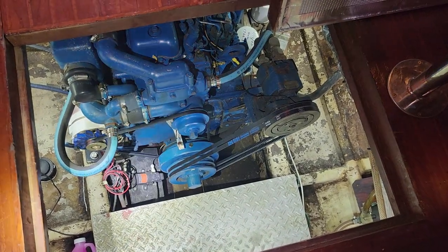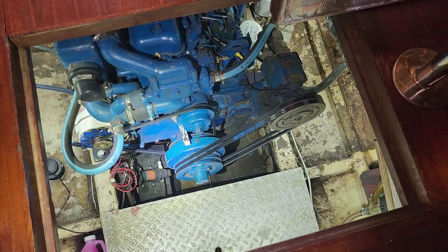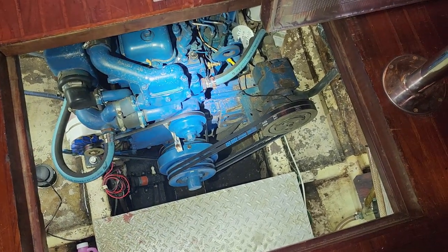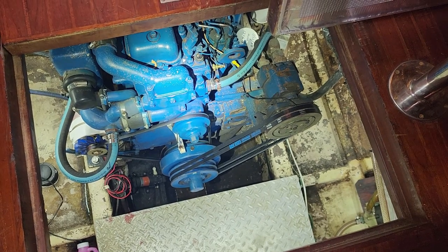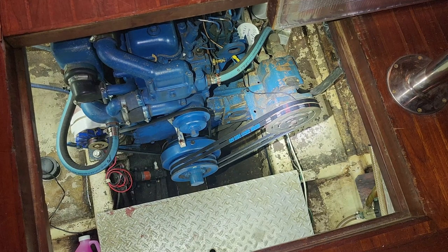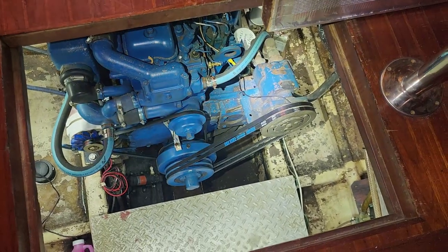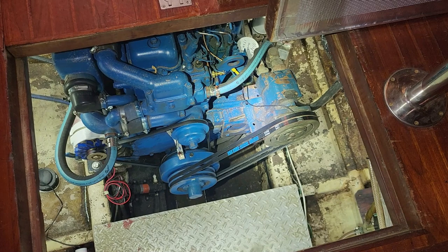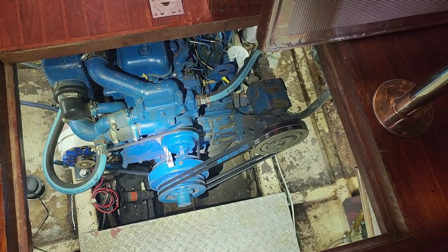The authority or horsepower of the thruster motor is variable depending on your RPM. A lot of times backing into a slip on a nice day, 700–800 RPM is enough to bump the thruster gently. On a sporty day, I'll operate it up to about 1,000 RPM — they recommend no more than that. One reason they don't want high RPM is because the clutch engages with a hard thunk, so high RPM is tougher on the clutch and components. A good strategy: engage at 800 RPM then throttle up to 1,100 for more authority at the stern thruster.